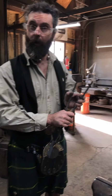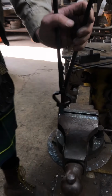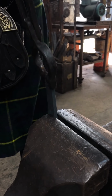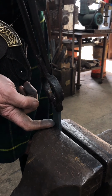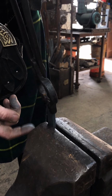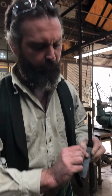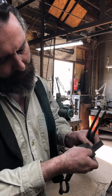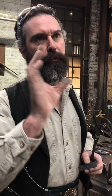Actually, I laid that up wrong, because my second fold is a progressive fold. So I actually have to fold the top line. I know this sounds ridiculous, but if I fold at this line, because of how it's being clamped, it's going to progress into this, so I'm going to lose an 1/8 inch in here. So I have to go to this low line and get that 1/8 inch to come out of my long leg, and then when I fold it on the block, the 1/2 inch block, I want to fold it again in a progressive manner.